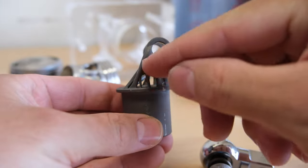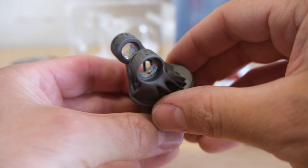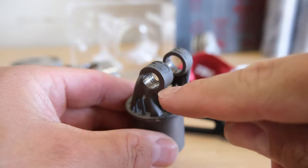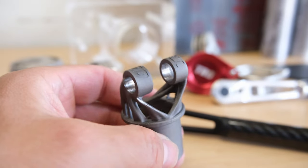This one — if you look in here — I reamed it out a little bit using a 10mm reamer, and then on this side I have 10mm by 1.5 pitch threads. I'm going to go ahead and tap this now.